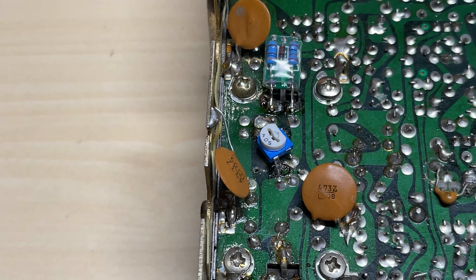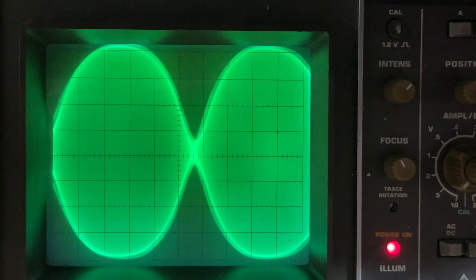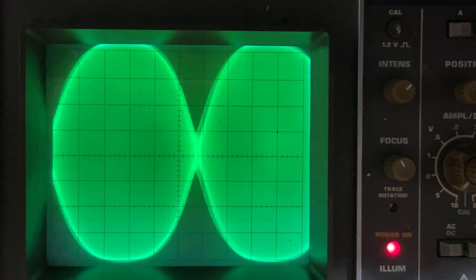On this one the bias is a little bit more twitchy than the old 5.9, so the bias has to be around 4.1 volts, which I've found is best. Once you've done this, I strongly suggest putting the output onto a scope and having a look on the two-tone just to make sure that the biasing is correct.